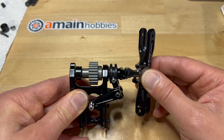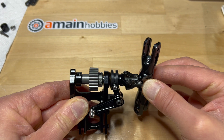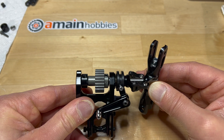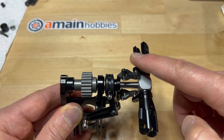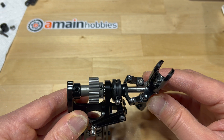And this one is perfect — this is one of my favorite features of the Tron 7 and the Tron 58. So this is a tail case, and normally there is a little bit of lateral play. I'm actually pulling and pushing the shaft, and you can see and hear the play. Normally, how do you take that play out? You just add shims on the end until you don't have the play anymore. But that's a trial-and-error, time-consuming process. At times you may add a little too many shims and you notice that the shaft does not rotate freely, which means it's over-shimmed — so you take shims out until you get it just right.